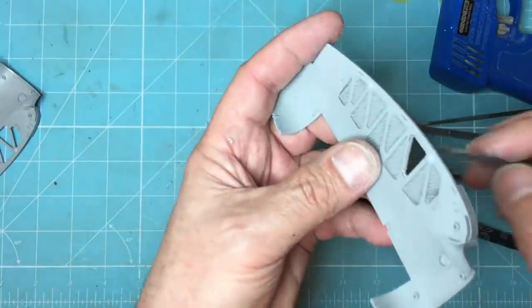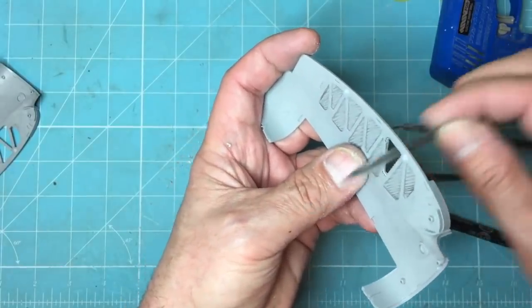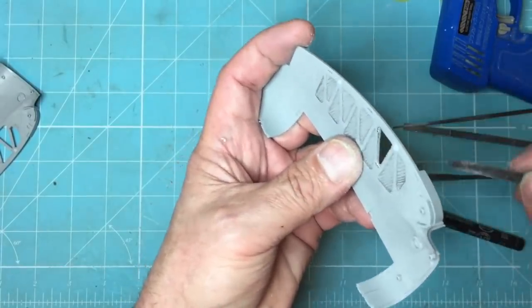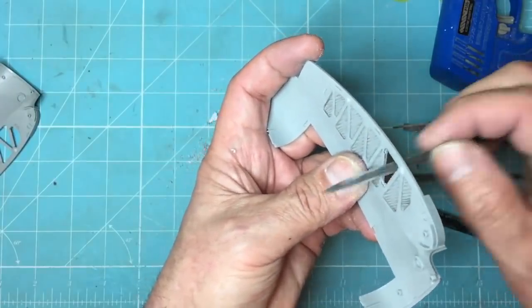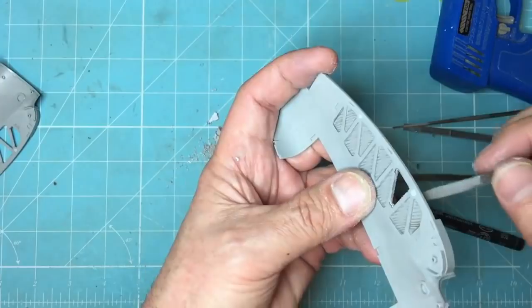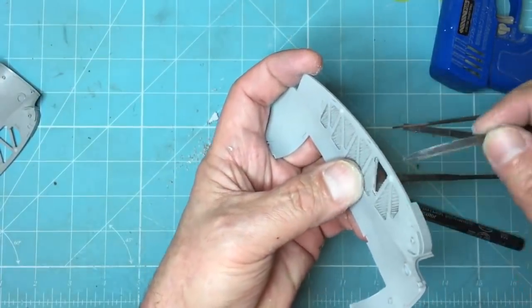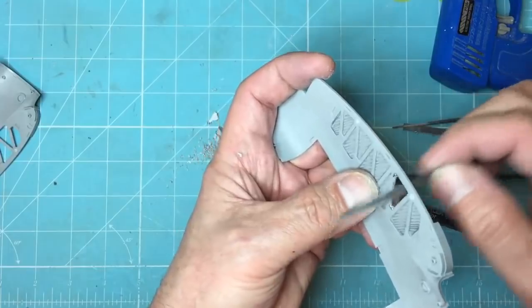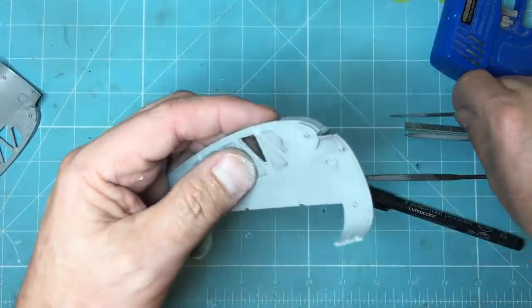If you watch on this face here, see that white line of dust? All of a sudden the black will start to reappear, and then before you know it, there you go, see the black has all come back. Before you know it, gone. And that's when you know when to stop. That's when you're on the edge. That was the whole purpose of putting the black ink on there.